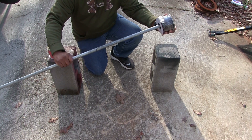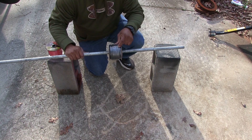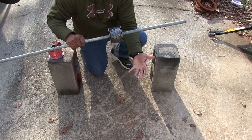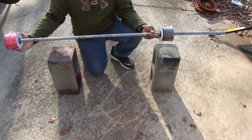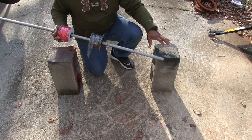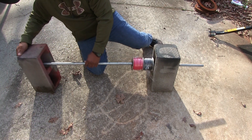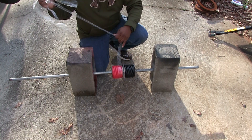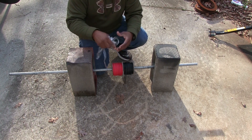Just slide the roll on. Make sure you can find where the beginning of the cable starts and which way you want to roll it off. Make sure you put it in that direction because you don't want it rolling off the bottom — I like to roll my stuff off the top. Find something that'll hold this conduit; I just got two blocks out in the yard. Put the conduit between the blocks, and now you've got a ready-made cable tray. You can roll off cable by yourself without a partner, and it'll keep everything in place so you don't have to fight with a spool on the ground.